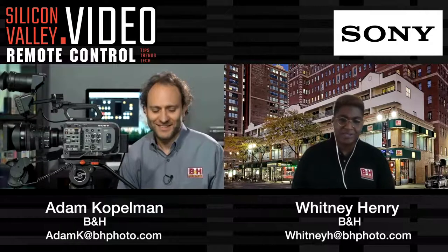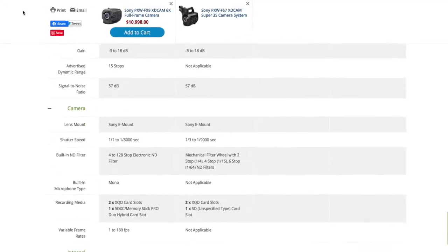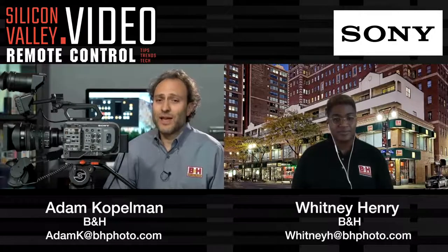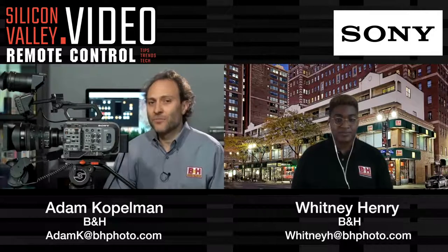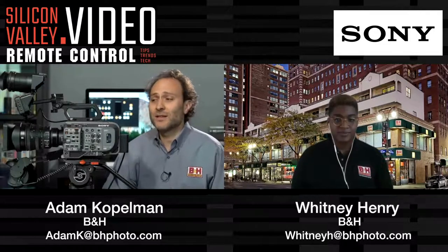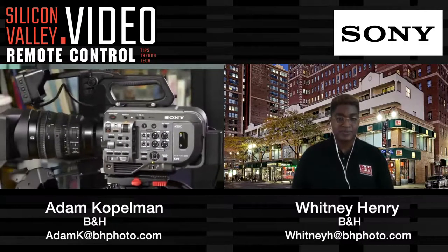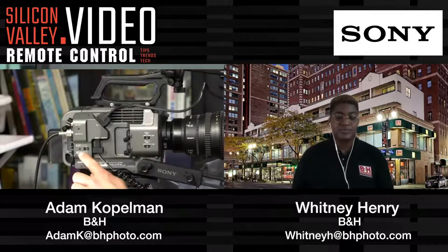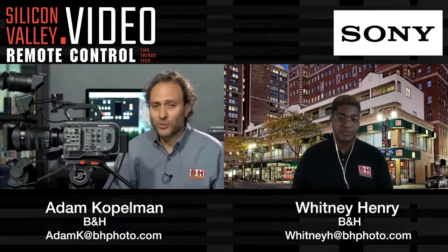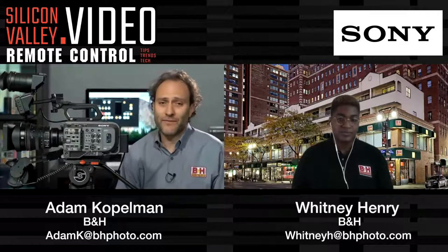There are so many new features and upgrades. How does the FX9 compare to the FS7? The FX9 has the 19-megapixel Exmor R sensor, while the FS7 is an 8.8-megapixel Exmor sensor. The R means the sensor is backside illuminated — the electronics are on the back of the sensor, allowing more light to hit each pixel, which makes the FX9 much better in low light. You now have four audio potentiometers so you can control all four tracks of audio from the body without going into a menu. Time code is included in the body itself, and the XDCA adapter can now output 16-bit RAW as opposed to the FS7's 12-bit RAW.